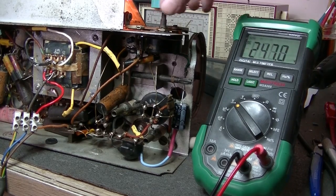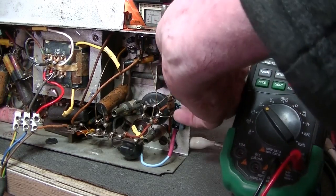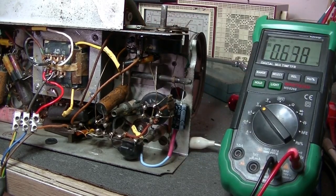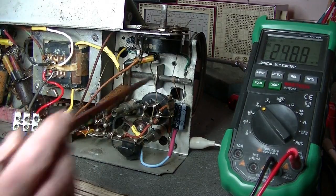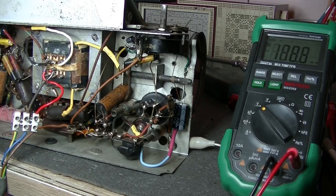But no sound - I've got the antenna attached. Oh, there it comes! Wow, it works! I can't believe it - all that effort and I'm so glad it worked. Very pleased! Had to turn the volume pot pretty much all the way up though - maybe a dud resistor. I saw one attached to it there but it's a bit dark, can't read the value just off the top of my head. I'll check that out. I'm going to fix that speaker up and glue it in, change those waxies, and come back at intervals.